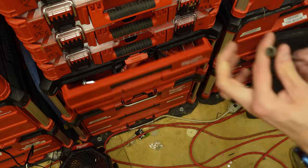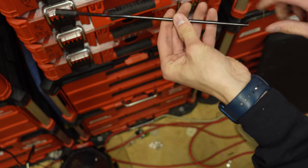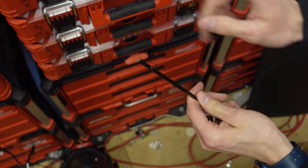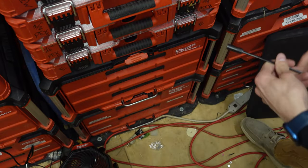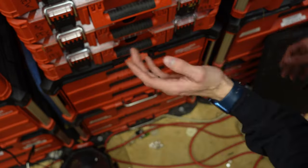This right here — if you're a plumber, I recommend you do this. I bought it at Ferguson. It is a screwdriver sink clip tool. I just cut that end off with a hacksaw, chuck it up into a drill, and it makes putting sinks in a breeze. Highly recommend you do that.